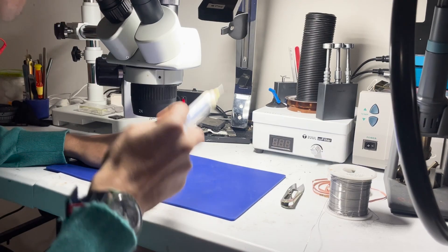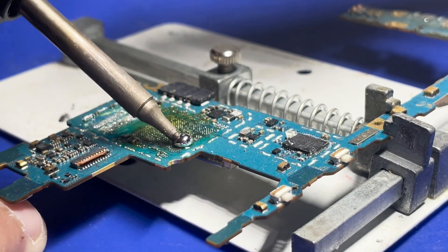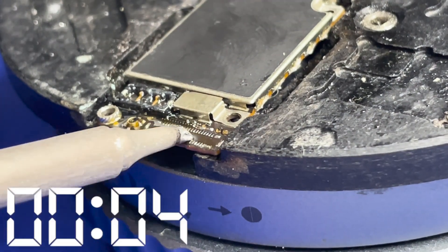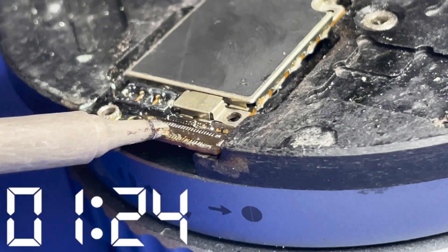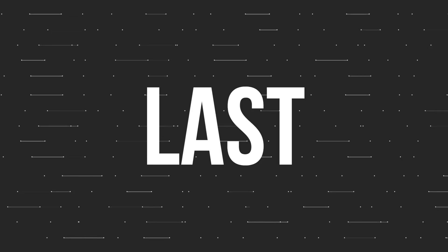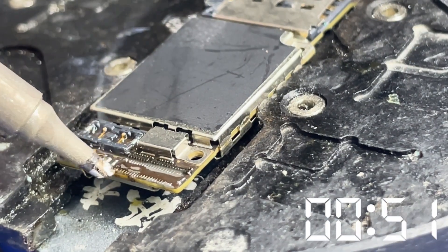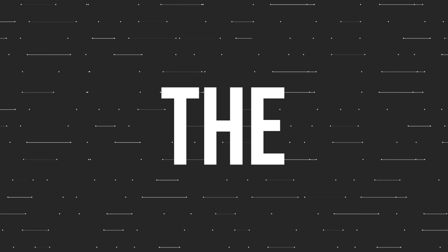What's the point of a flux if it can't make solder flow? So we have two identical iPhone boards, and we're going to be judging on how long it takes for the flux to oxidize. Starting with the TCRS, I made the puffy pillows and then went back and forth — the TCRS flux lasted 1 minute and 25 seconds until it completely oxidized, meaning you can keep your iron on the same flux that long. The Ugain lasted 55 seconds in the same test — not bad at all at $4, and you're getting the same amount as the more expensive flux. The winner for formula is without doubt TCRS.